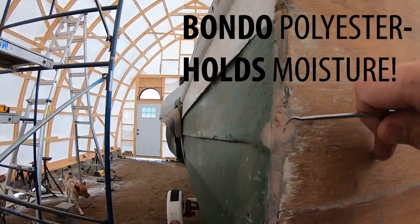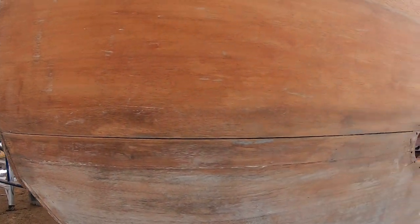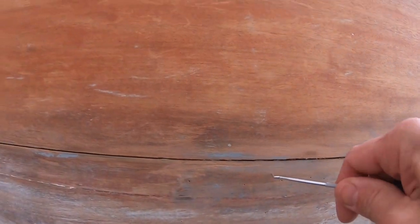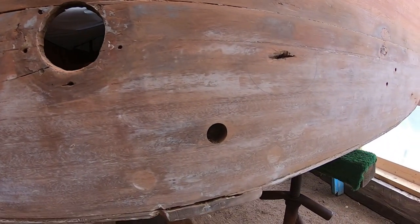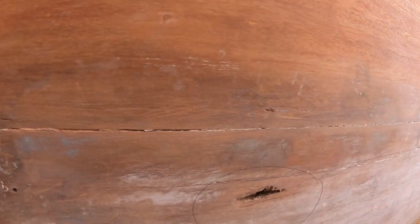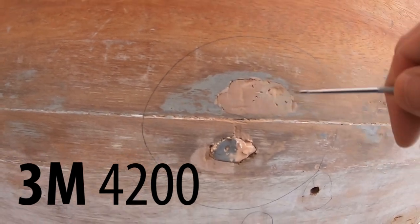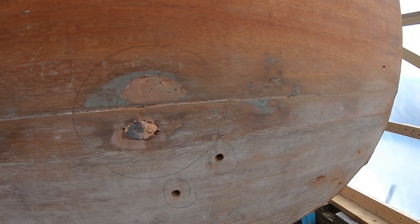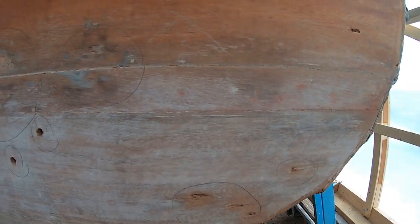Right here is a big problem — this is Bondo. You do not want Bondo in a boat; that's made for repairing cars. We've got it down through here and here. We go down across the bottom. This area around where the exhaust was coming out looks suspect — if you poke it, it's obviously not the greatest; that goes right in. Here is obviously a place where it's rotted out, but that's probably just a Dutchman, depending on what we see inside. This is 4200 — you can see how it's kind of rubbery — and this is Bondo again. Here's where the two sheetrock screws were added. We've got a couple little spots down here that don't seem too bad, but again, we need to look inside.